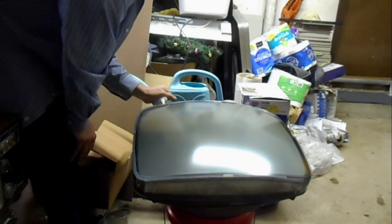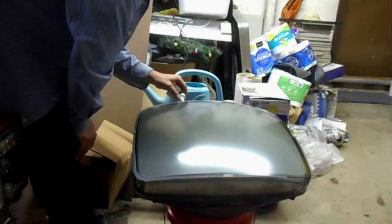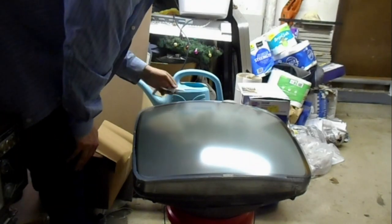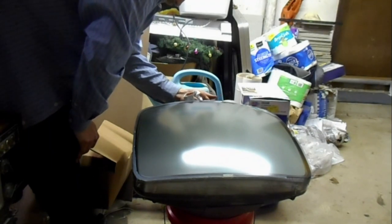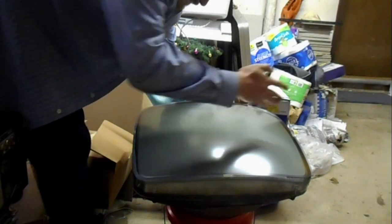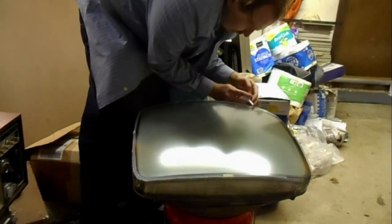I figure that when the cataract removal is done, if you silicone the safety glass back on a round CRT, you're effectively converting it from the 21FJP bonded style to the 21FBP gasketed safety glass style. As far as I'm aware, there were no gasketed rectangular color CRTs, but I figure if this conversion is safe on the round CRTs, it probably is safe on the rectangulars.